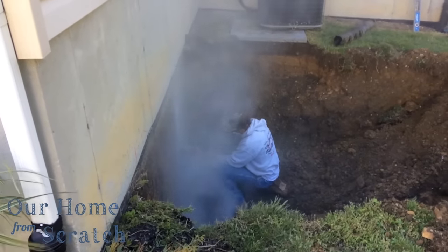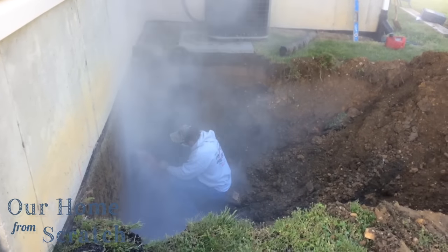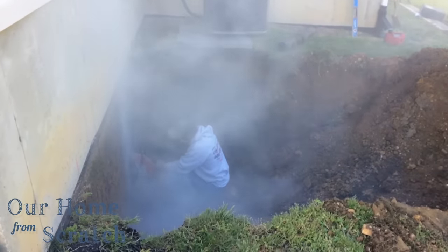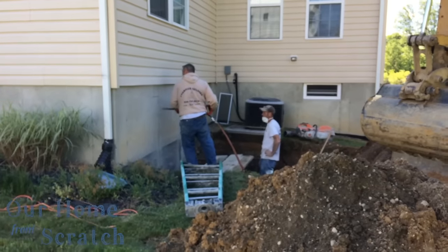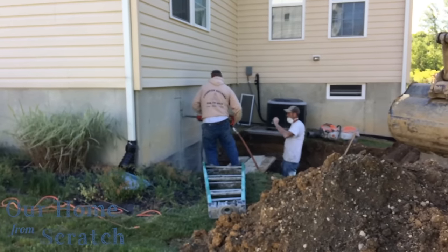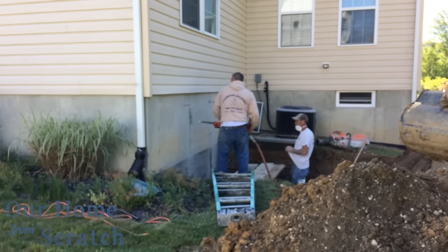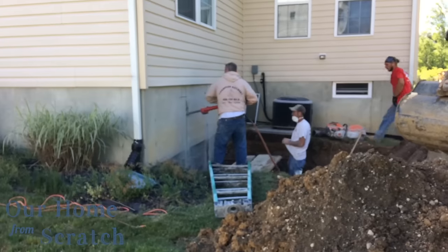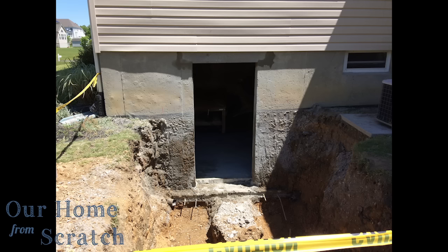Then they took basically a concrete saw — gas powered — and made cuts both on the inside and the outside along the doorway lines. There's a lot of dust, and you can see we put up some dust protection and water protection, and had to pull the insulation off the wall. Then it was jackhammer time. Once the cuts were made for the doorway and the lintel, they spent about half a day jackhammering out the slab, because you can't just make a bottom cut and pull it out. This is a close-up of the lintel — it's a precast stone or brick lintel — and this is the view from the outside with the doorway cut.